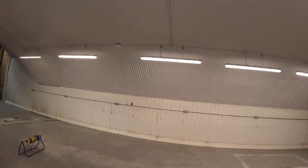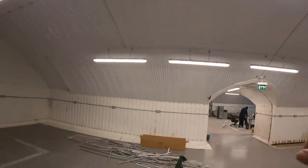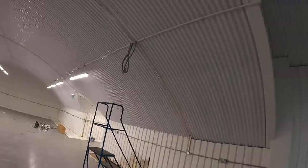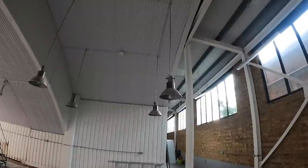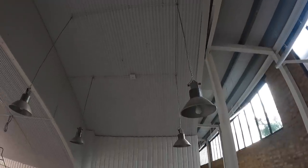I had to re-jig that fitting in the middle here. We ran that — reinstated that line of conduit, same thing over here. We had to redo this bit of conduit here, put a box in for that fitting, and we had to do that one as well. These two have got to come down. Another one of these fittings is going to go here. Switch line's got to come down, go over to the switch over there. We have to fit a five-foot fitting in this position here. These two fittings here are going to come down and we just put blank plates over those box lids.